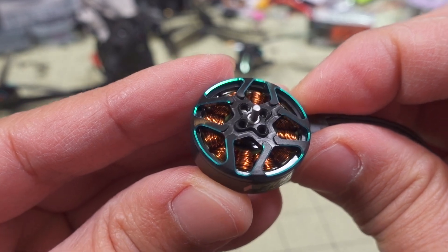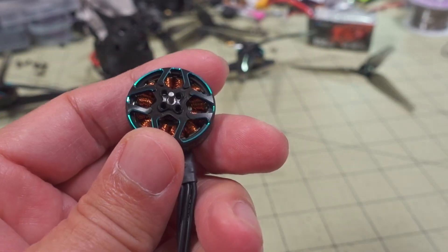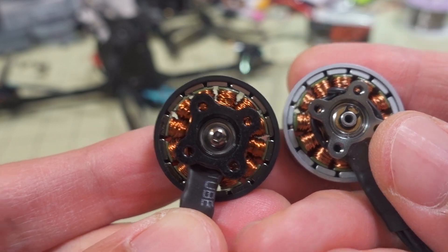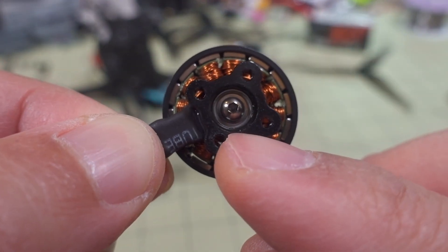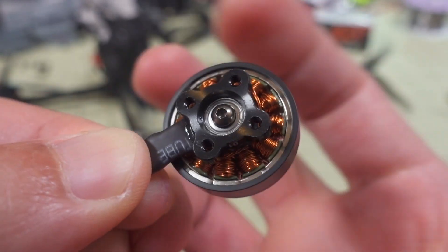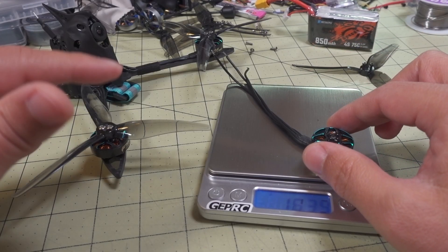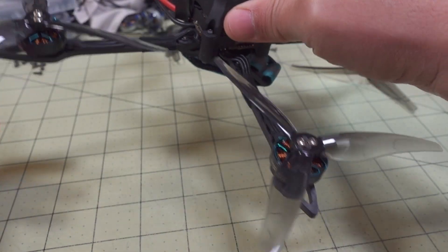Here's a quick look at the motor — I also posted pictures to Instagram. The windings look pretty similar to the ones in the BFU motor, a little bit thicker it looks like, and it looks like curved magnets. The quality from T-Motor is a little bit better, and the shaft is also a little bit bigger — two millimeters. The bearing is 7x3x3, pretty standard, not a super large ring but fairly smooth for the size. This comes in around 16.3 grams with the full wire, though I cut some of it off when soldering to the flight controller.